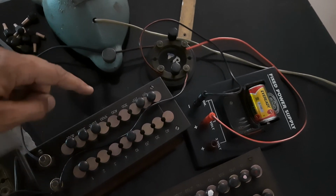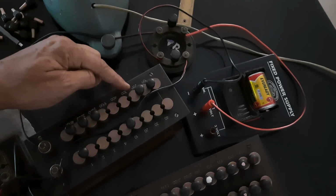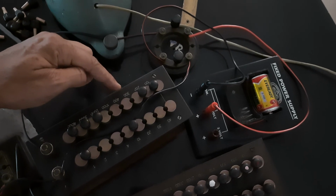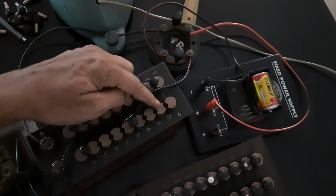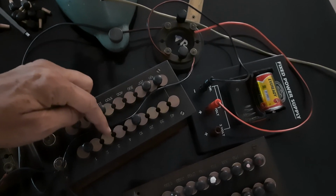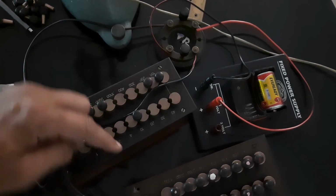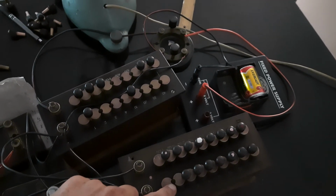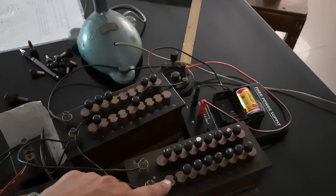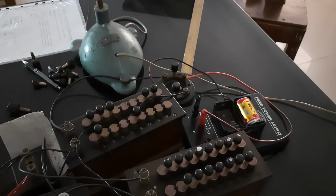Right now I have adjusted 1000, 400, 300, so 1700, plus 40, 30, 20, so that's 90 and 90, so 1790, plus 1800... 1799, and the P is just 1 ohm, and therefore the summation for our present setup is 1800 ohm.